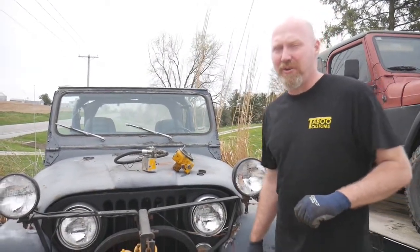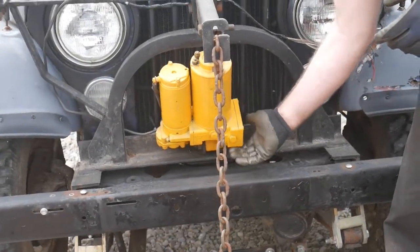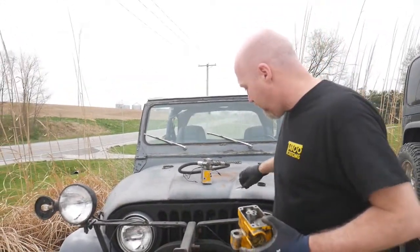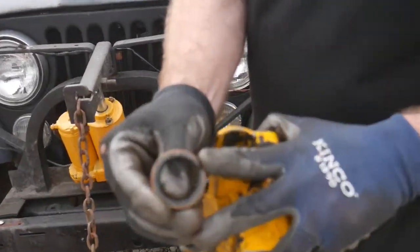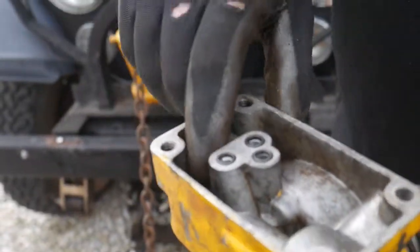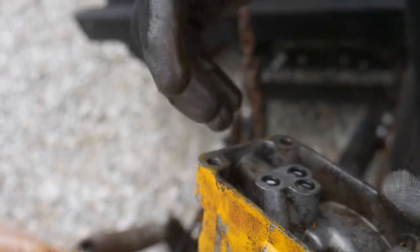But we did run into several issues with the plow. The first thing was we had a lot of issues with our pump — when we tried to use it, we had a lot of oil just pouring out and it really wouldn't pick up the plow. A common Meyer snowplow pump issue is that whenever these pumps get water in them because of faulty seals — and you can kind of see that the seal was not in good shape — they will actually crack this port down here. There's actually a crack right down in here, and that's what was causing all the oil to pour out.